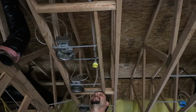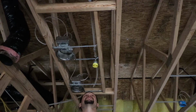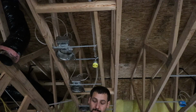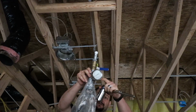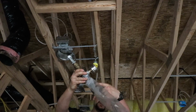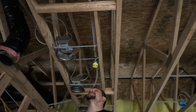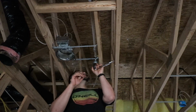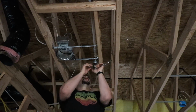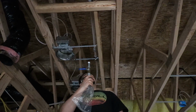We have tied in the sprinkler head to the water main. Well, in this case, the water line is a 3/4 inch type A PEX system. And we have our test assembly, which is the valve, the nipple, the gauge, and the dummy, well, a real sprinkler head that I set off like you guys saw. And we're going to go ahead and take out the real sprinkler head and install the test fixture so we can get ready for the test. We have our test fixture.